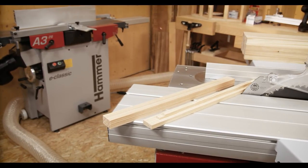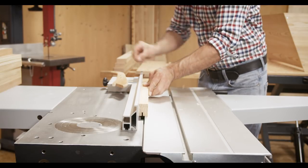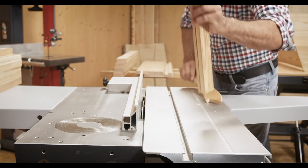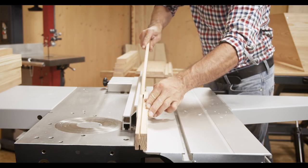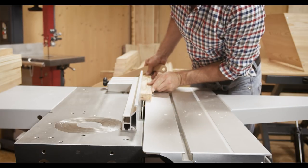The insole rails seem to be quite the challenge, but the effort will pay off, as we will see later. For the first fold cut, the adjustments to the circular saws stay the same for the horizontal and vertical workpiece. This way we save time, and the cutting of the rails is soon complete.